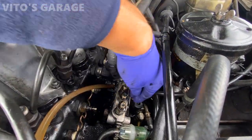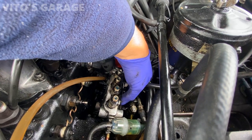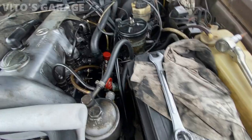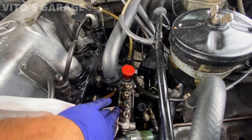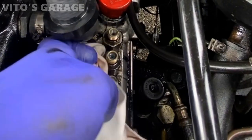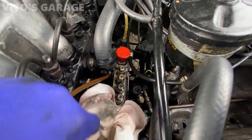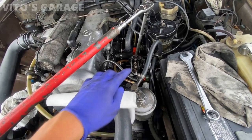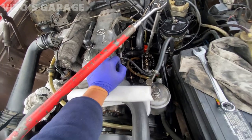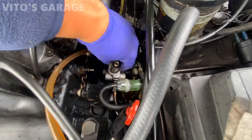The next part is taking these aluminum blocks off — already loosened them. Once these are off, do a bunch more cleaning right here. Make sure everything is as clean as possible before loosening the delivery valves. To loosen these delivery valves you need a three-quarter-inch or 19 millimeter thin-wall socket, and just a little bit of force. Support it and loosen — starting with one first.